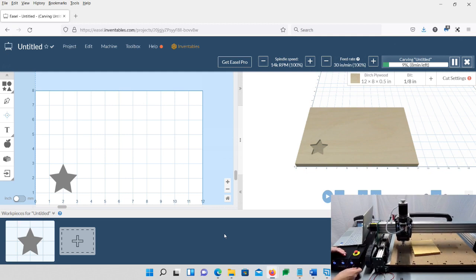Looks good. While we're here, one last test is to hit the E-stop button. But one thing I want to show you, and I see some other people do this, is if right now, for whatever reason, I touched this on here, it would stop it as if it hit a limit switch. And that's why I always put this away. I see other people that have this just laying down there, and if it hits the ground or something, it's going to stop your cut in the middle of your cut, and pretty sure you're not going to be happy when that happens.